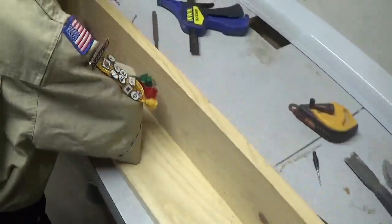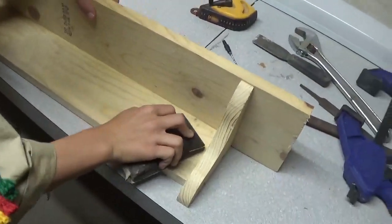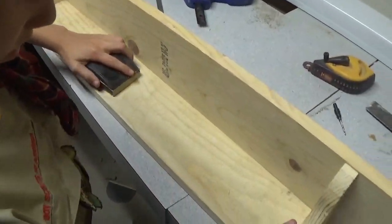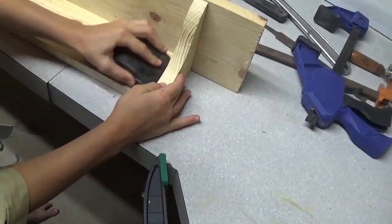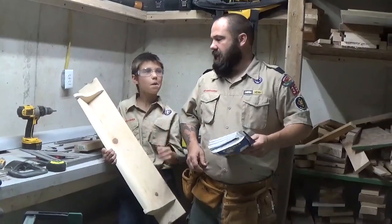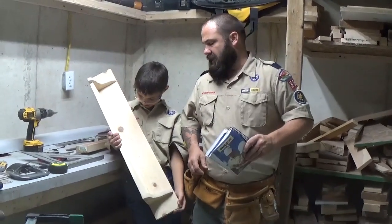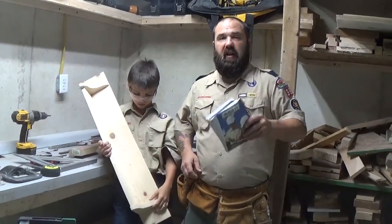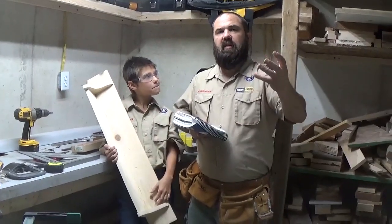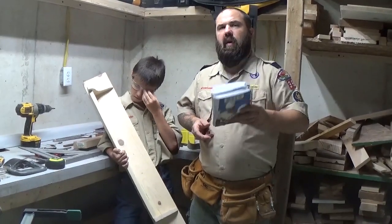Austin is now using his sanding block with some sandpaper, which comes in different grits. The lower the number, the higher the grit — it means there's more material being taken off. A really high number, like 220 or 400 grit sandpaper, is for your finish work. You should always start with the lower number and work your way up. If you're okay using power tools, there's orbital sanders and disc sanders. Austin's got a little bit more work to do on his finish work. He's going to finish sanding it. Are you going to paint it or stain it? Paint it. When you start putting paints and stains on there, the grains kind of open up and they raise up, so make sure you get it sanded smooth first.